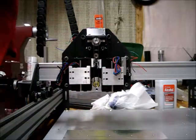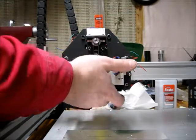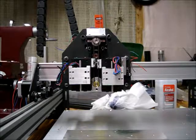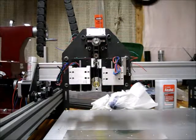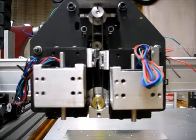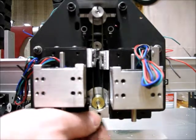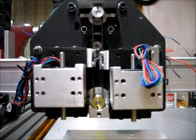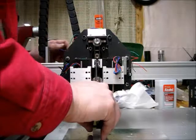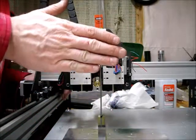This surface and this surface were square to each other, but something's causing that thing to tip this way. I wonder if I got something caught underneath it — it's really tough to see what's going on under there just because of everything in the way, and I don't have a good mirror. This is nice and flush. I don't know exactly why that's tipped the way it is; there's no obvious reason at this time. It's tipped just slightly that way, which causes everything to go out of tilt.